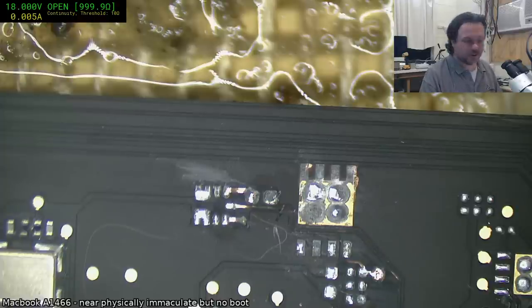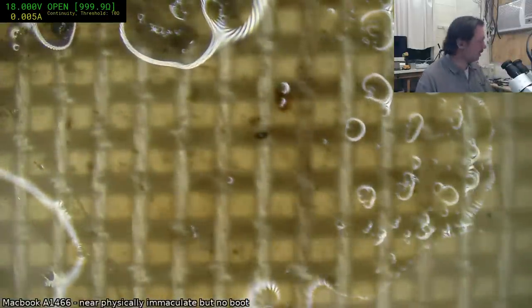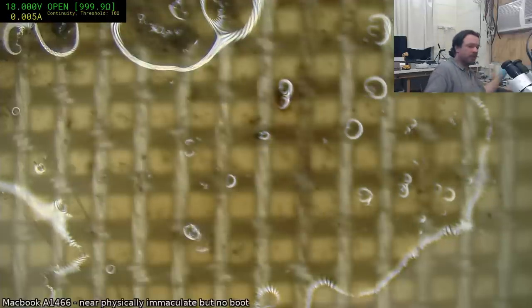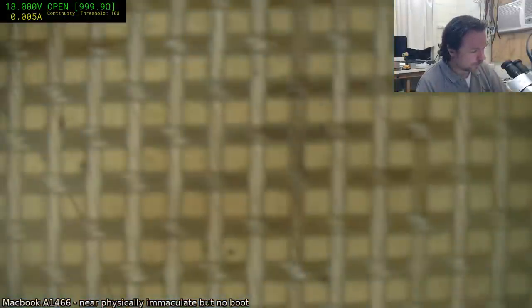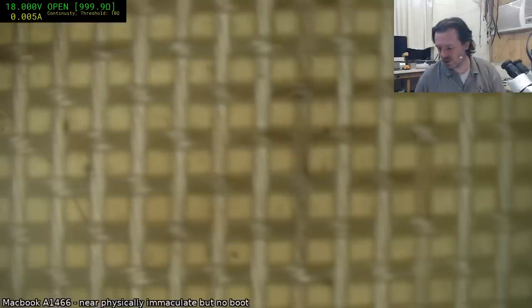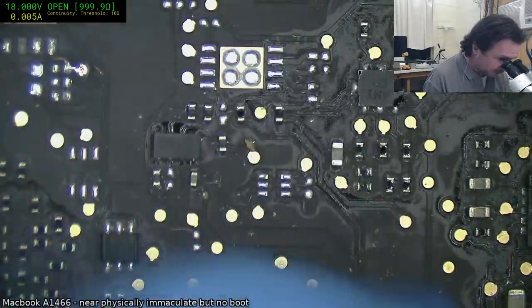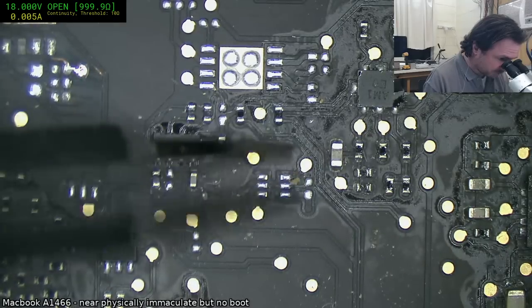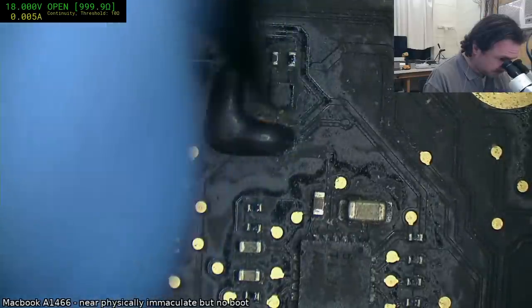Yeah, it was impossible to hear it. I definitely couldn't hear it. More often than not, I would imagine that I was hearing it rather than actually hearing it. Now, at least I can hear it. The only concern I have is I don't know what the milliamp loading is going to be on the meter circuitry, but I can't imagine it's too much. And I did see that there was a current limiting resistor on the pin to that positive line, so hopefully, fingers crossed, it doesn't destroy my meter.